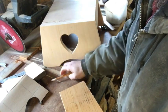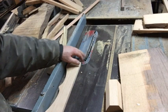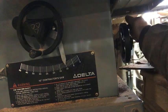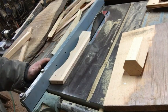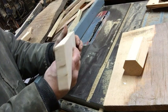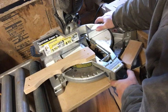Here we have the little side support pieces. This 10-degree cut was made on the table saw, accomplished by setting the table saw to 10 degrees. On this Delta contractor saw you just run the handle counterclockwise until you get to the 10-degree mark and lock the handle in place. When you have your blade set up to 10 degrees, measure over with a tape measure however far you want for your skirt, set your blade, and run the piece through to get that 10-degree cut. This will flare out to the side a little bit and be level on the top.